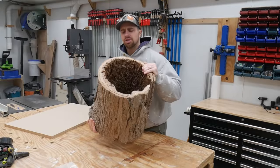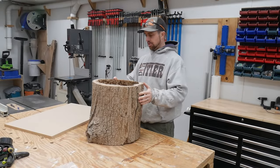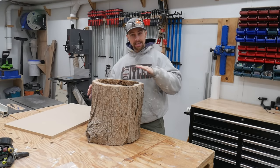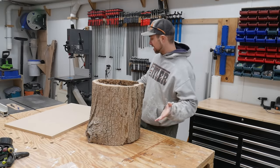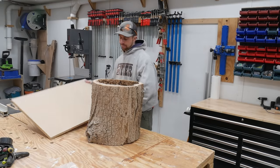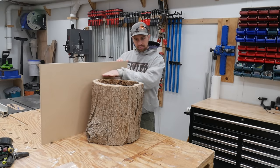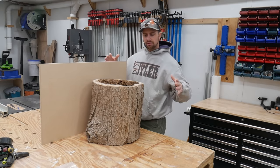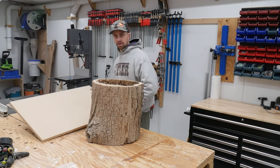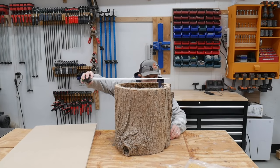This is what we're starting with, and honestly I really have no idea what I want to do. I do know that I need to get the top and the bottom flat, and I'm going to use a type of router sled to do that. I'm going to cut down some MDF to just above the top surface, make a little sled for the router, flatten one side, flip it over, flatten the other. The bottom is actually pretty good; the top is pretty bad.